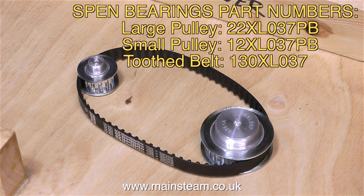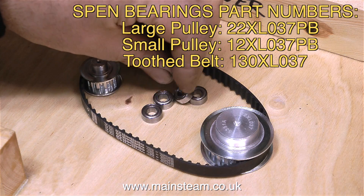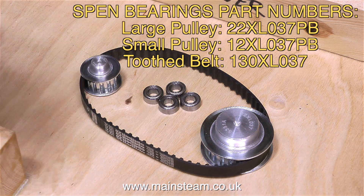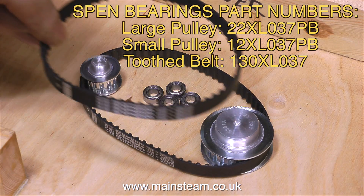The really useful thing about these pulleys is that there isn't a hole drilled through the middle — they just have piloted holes as a guide. So in the larger of the two pulleys I will be drilling and reaming a hole a quarter of an inch in diameter, and in the smaller of the two pulleys I'll be doing the same to fit on the motor shaft, which is 5mm in diameter.